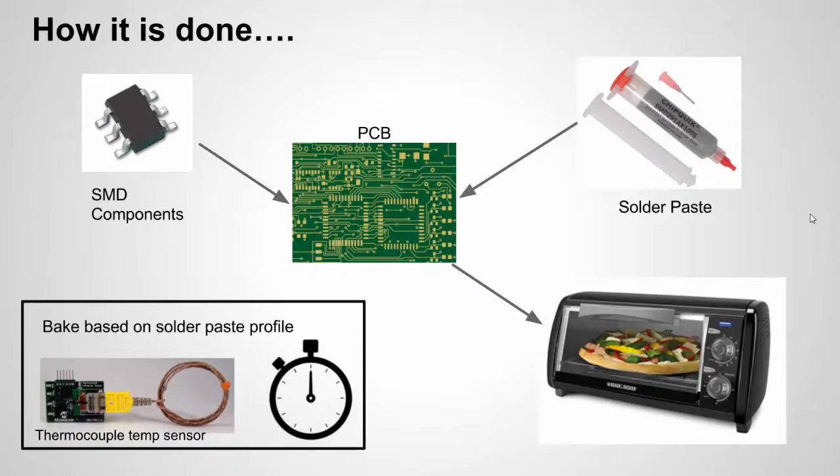One perception that makes people think this is harder than it is — they think they have to get the solder paste exactly right or everything's going to go wrong. Not really. If you're familiar with soldering, the solder will flow — they call this reflow. The solder will flow to the metal that's heated, so you don't have to get the solder paste perfect. You don't want to put too much on, but it will flow and make the connection for you.